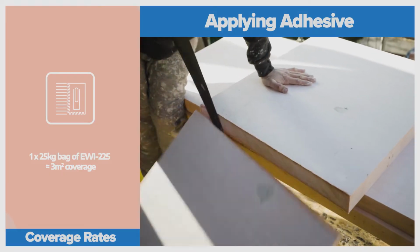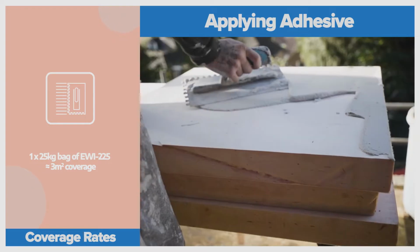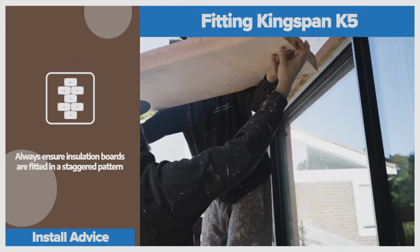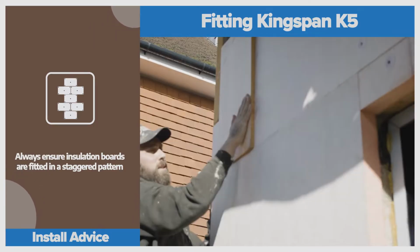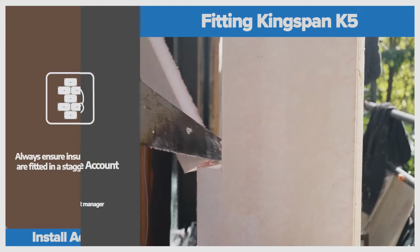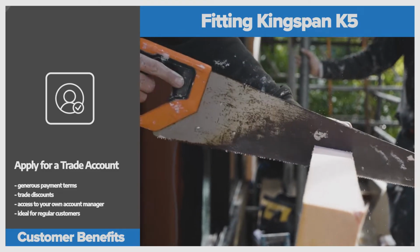Tom, the installer, chose to apply the adhesive using a notch trowel and completely covered the back of the insulation board. This is where it's helpful to have a dual-purpose base coat adhesive on site. The same EWI 225, which was used for attaching the insulation, can also be used for the base coat layer along with EWI Pro fiberglass mesh.